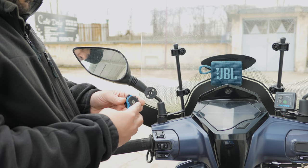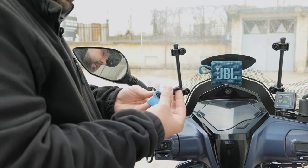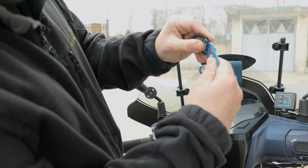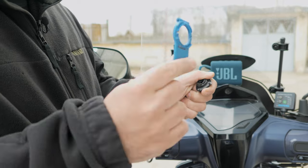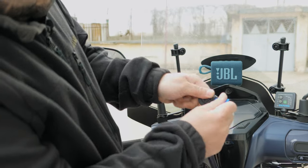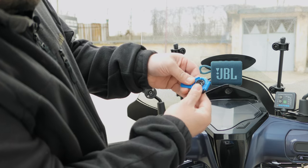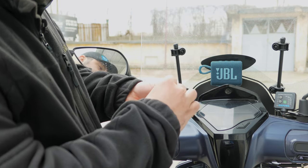We've taken the head off — the mount is still here. The way you're supposed to change the lever is to take the screw out, don't lose it, take this part out, and then you have the lever. You tug on it and this metal part should come out. The old lever is out now. Let's put the new lever back in. It's in — now the metal part, the spring, like so, and close the lever on top of it. That's your new lever. Now we just put this part back on.